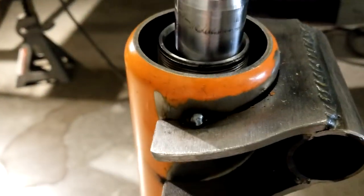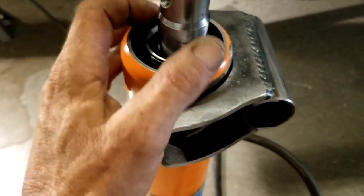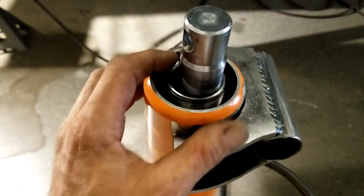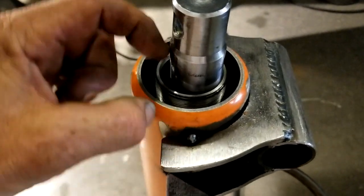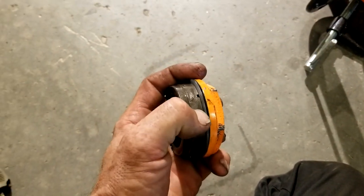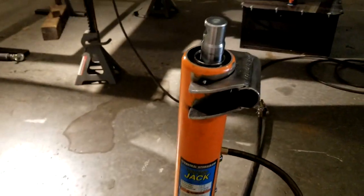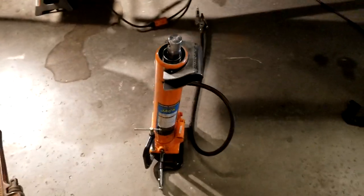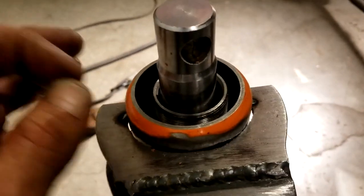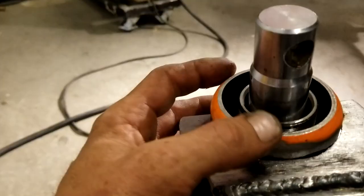Down inside there we've got the ram and then the internal cylinder - that's where our ram is at, essentially our hydraulic ram - and then this is a reservoir. I wanted to take the gland nut off so that we didn't melt this plastic seal, and also so we can let any hot air and smoke out of there, because we're gonna weld this up permanently since we're not gonna use it anywhere else. I didn't need a mount that was gonna be bolted on. That material is pretty substantial - it's like 11 gauge material throughout this whole can, especially on this end where it's squished.